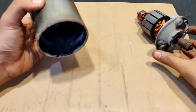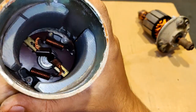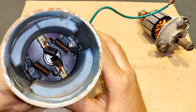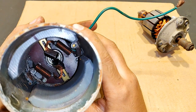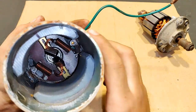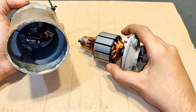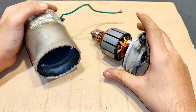Let's see the inside view. The magnets are also pretty good, and the brushes are also very healthy. I have to take the back off and then rewire it. All I have to do is connect one more wire because one is broken, and then check if the bearing can be oiled and used again or replaced.